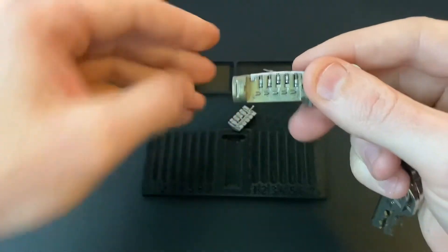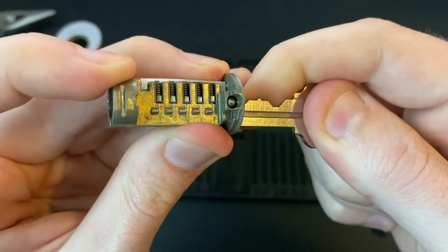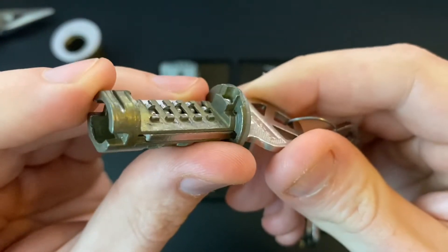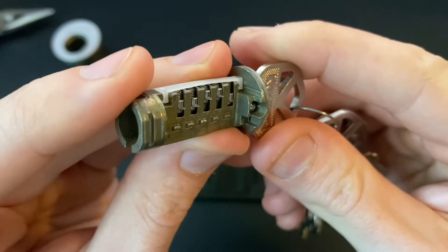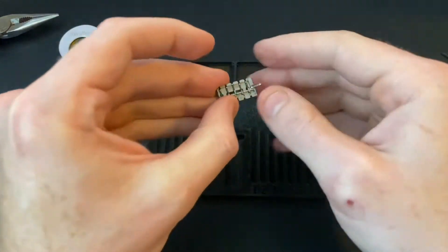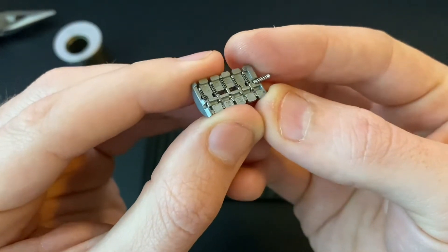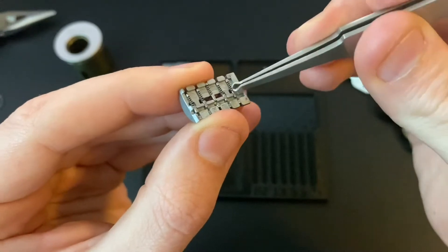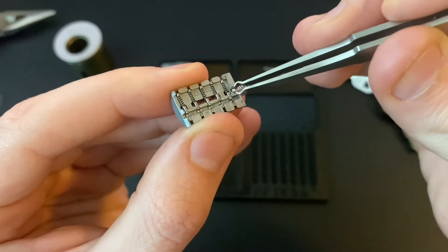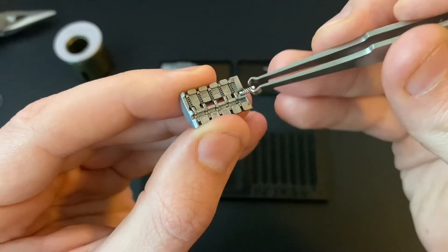So I'm going to take this off so you can see these parts separately now. First I'm going to talk about this. You can see there are the pins — they are currently lifted, but if you pull the key out, there's where they're at rest. You can see they have those fins on them, which I discussed — those interact with the sliders. So they will fit into right there. You can see the notches in the upper part, where those fins are going to fit into. You can also see this big groove at the bottom — these have to be lifted correctly for this groove to be completely clear. This is what makes it so that you can't push the reset carriage back unless the key is in.